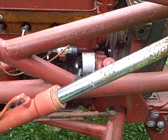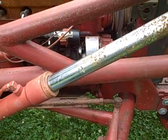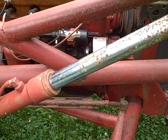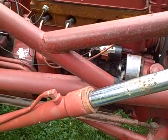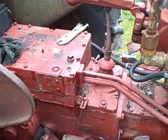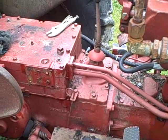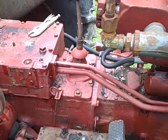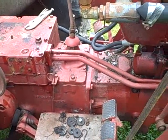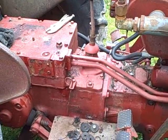While I'm draining the bowl, I'm going to take a moment to check the engine oil level. The reason I want to know the oil level before I start is because the big question is: why is the hydraulic level so low? The hydraulics obviously wouldn't work with the level that low, but why are they that low in the first place? One possibility is nobody ever got around to taking the seat off and adding more hydraulic fluid, and it just got lower and lower over time. But the more probable answer is that we've got a hydraulic leak - either internal or external.